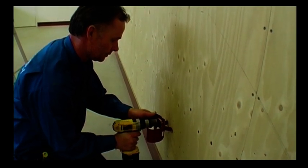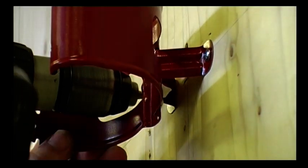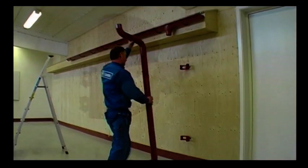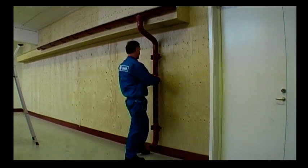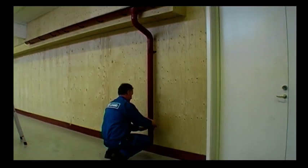If you have stone walls, drill holes, add raw plugs and fasten with a screw. If you have wood, you can simply screw the pipe holders directly into the wall. All that remains is to mount the pipe. I slip it onto the gutter outlet, adjust it, lock it in both places, make small adjustments and snap the double locks closed.